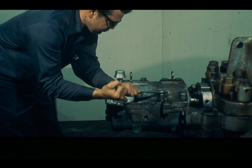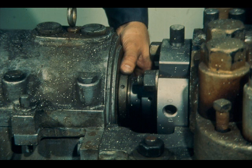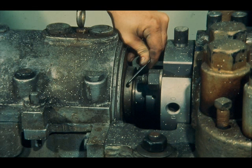Once the end play is satisfactory, replace all of the bolts in the top half of the bearing housing and tighten them. The remainder of the assembly procedure can be completed now. The workman is installing the oil pump after first installing the pump coupling. Since there is much variation in the oil supply system from one piece of equipment to another, we won't go into detail here — just make sure your assembly is correct. Refer to the manufacturer's manual or ask your supervisor if you are in doubt. The only remaining task is to place this deflector in its original position and tighten the lock screws to secure it.